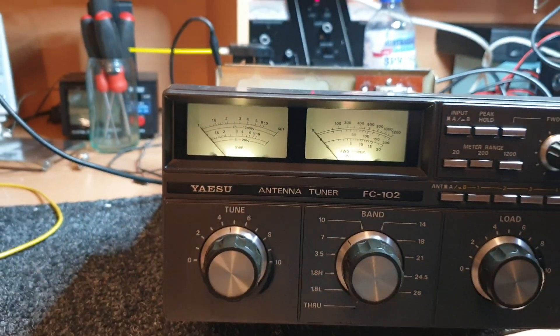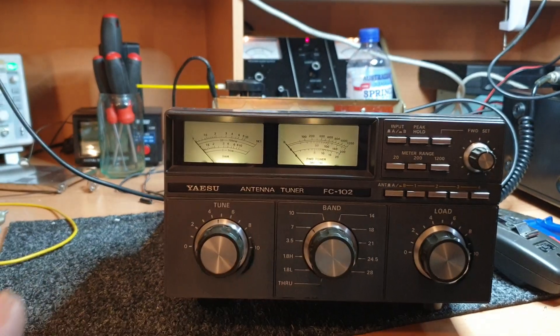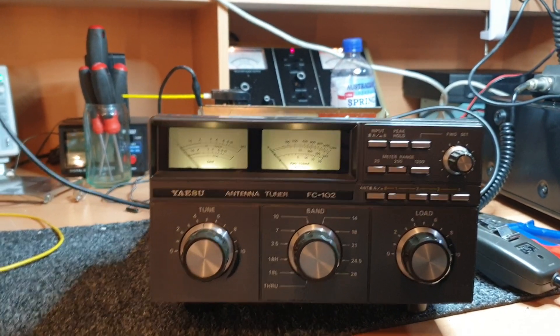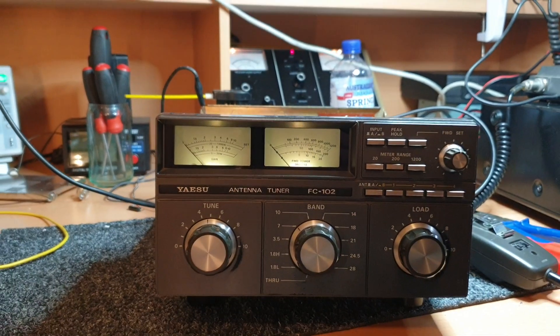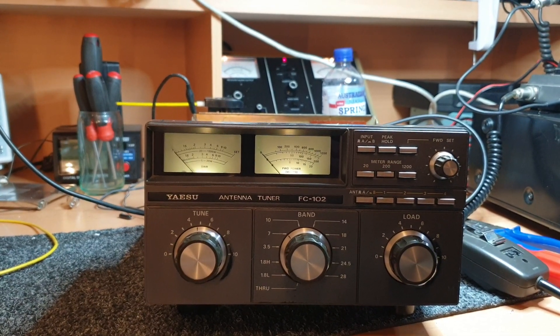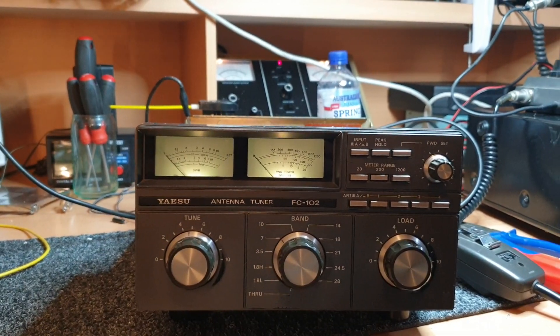Please don't do that — I did that for a reason. I wanted to show the meter working at 100 watts output and that it's all calibrated and doing it. Ideally, if you can tune with as little power as possible when you're running around trying to tune your bands, life will be a lot better for you in the long term — not just for the tuner, but more so for the radio.